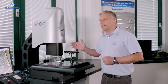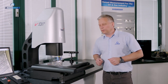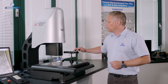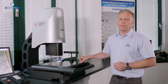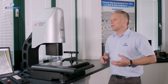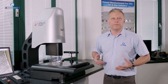We have non-contact measurement and contact measurement using the standard Renishaw TP20 touch trigger probe. On this model you can see the optional six-port Renishaw rack changer. The software allows us to manage multiple probe modules, and with each module we can have a multiple stylus setup. The software manages the calibration status and positions of all styli without any operator influence.